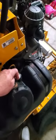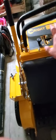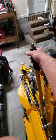It's got the Kawasaki FX600V — I like that motor, plenty enough power. I want to say this is a 5-gallon gas tank. Got the fuel gauge right here on top, your brake lever right here, your ignition, your hour meter. I already put 1.6 hours on it today. Got your PTO switch right here, your throttle and your choke. And of course you got these famous Wright handles — I don't know what to think about those yet. We'll talk about that in a minute. You've got your deck lever right here.